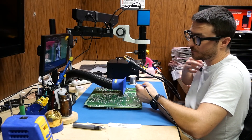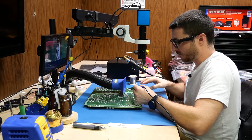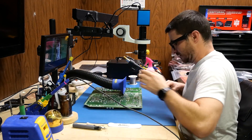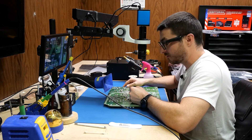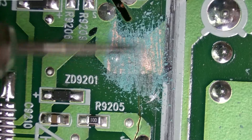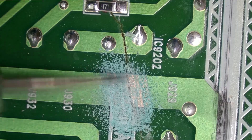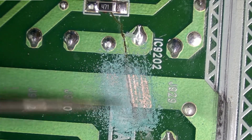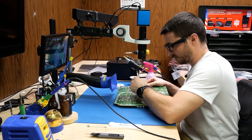That just popped. I think what's happening is I'm actually melting or burning the super glue that I put on there. The board shifted a little bit, which spurted some of the solder on my chest. That's why you want to wear protective glasses, or just wear very large glasses like I am. Now we're going to do a couple of the ones in the center of the board. Some of these are a little harder to get through to the copper because some of the super glue seeped through and is protecting it, so some areas require a little bit of extra scratching.